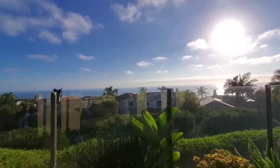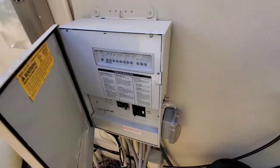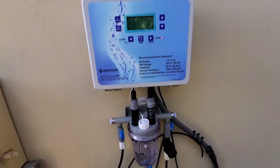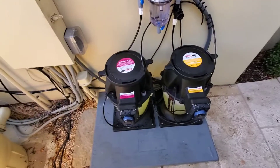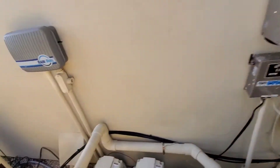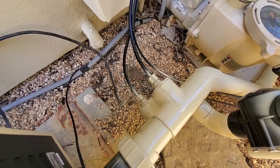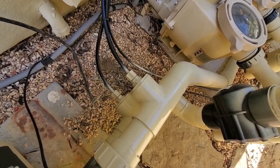The equipment's over here. It's a little noisy, so I'm gonna shut the pump off. Here it is — there's the system. There's the controller on top, the pH and ORP sensors, and here's the acid tank and the chlorine tank. On this install I probably didn't need to, but I actually hard plumbed the fittings in the kit. It comes with different parts, but I added PVC T's just for better durability.